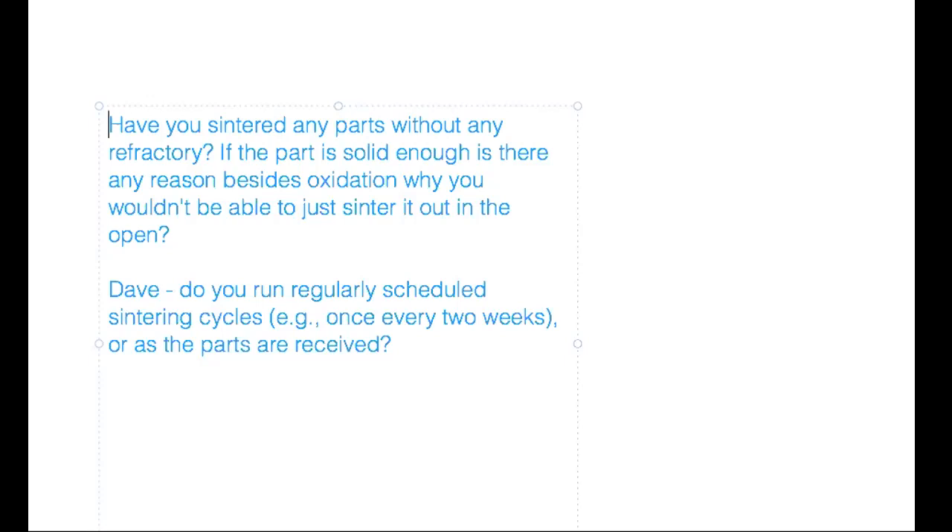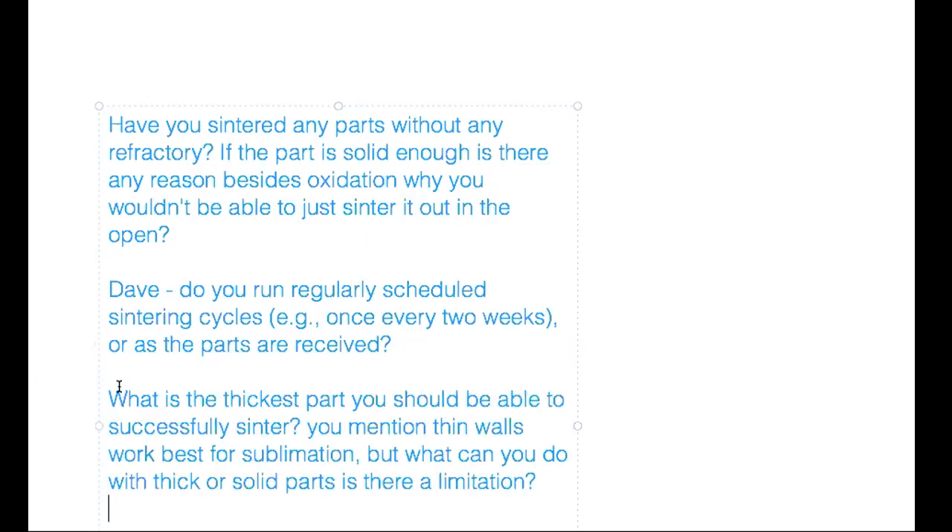What they really want to emphasize is that metal parts are really attainable. You've got a printer, you can use their material, and it works — way better than it used to be. They're trying to get sintering to the point where it's very accessible. There's a pretty affordable kiln option for someone looking to use the kilns used in development, because there's no development work required on your part — you can follow the process and it works. They're really excited to keep developing other cycles for other materials.